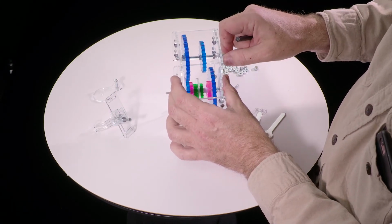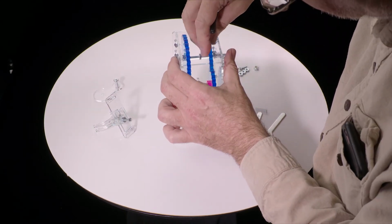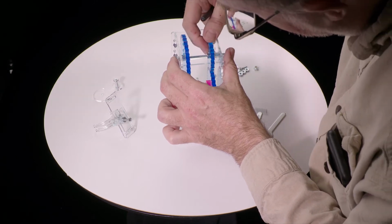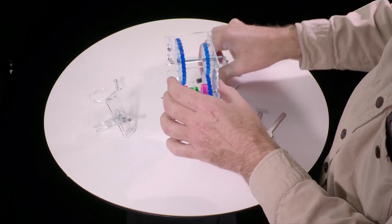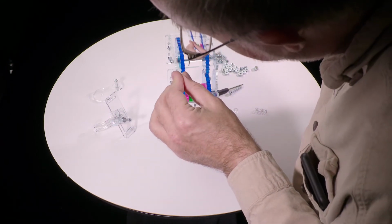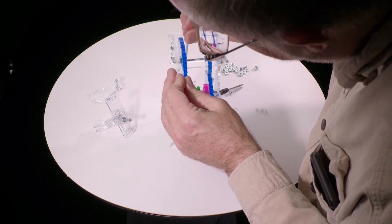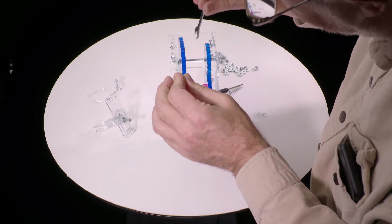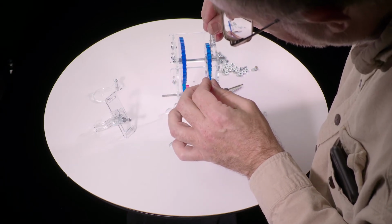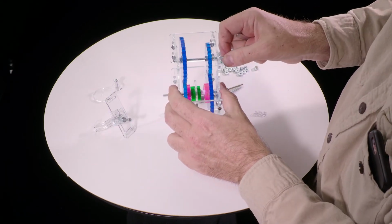So this should click back and forth just a little bit. Then slide the gear over and spin this nut up against that. Okay, now we can use the 2 wrenches to tighten these and turn them both at the same time. Get them quite tight. And here also. Quite tight. And then check again that it's got the right amount of play. So this is just right.